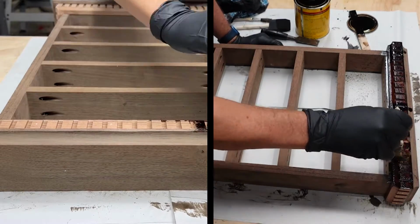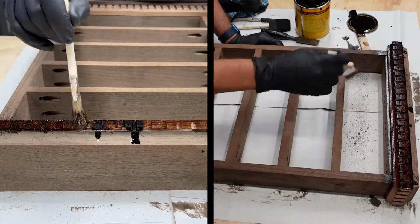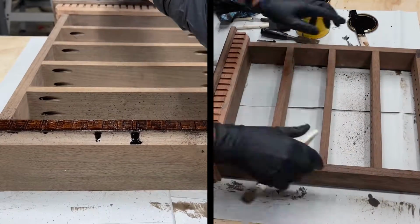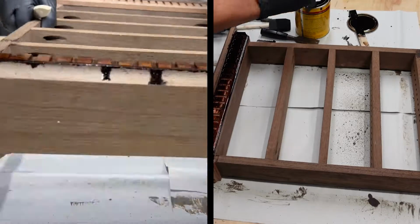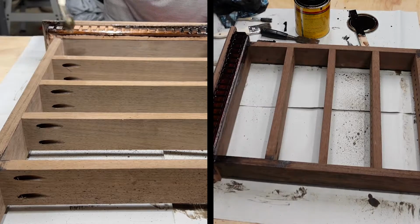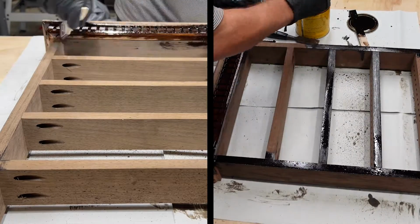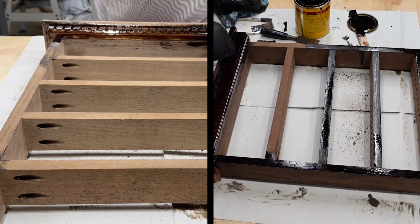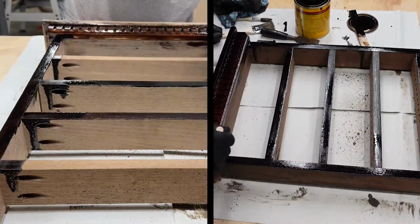After Gus spends a good amount of time filling brad holes and cracks, then plenty of sanding, he takes to staining the case dark walnut. His son Paul has a beautiful home office with a lot of dark furniture that will match the display case. As you can see through this sequence, Gus soaks in the stain, allowing it to penetrate deep into the wood fibers, then wipes off with a cloth.